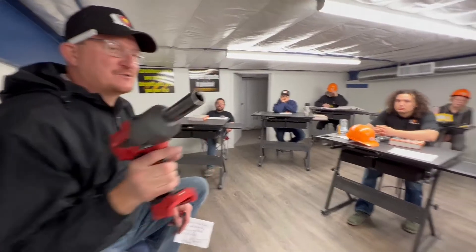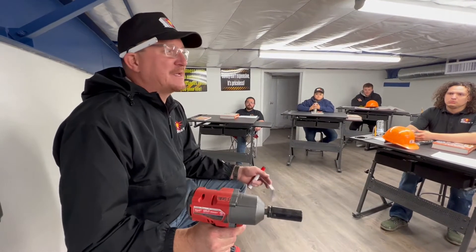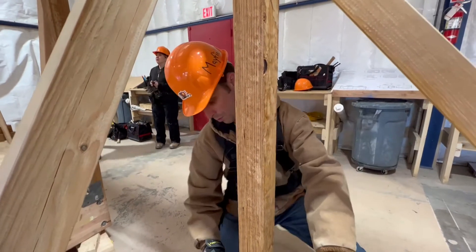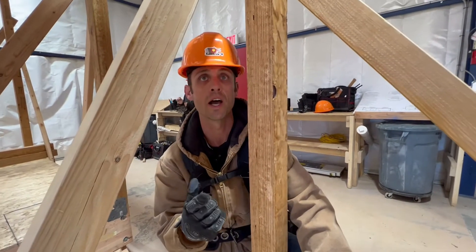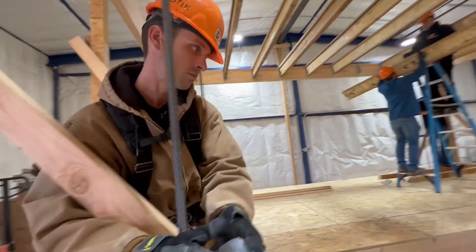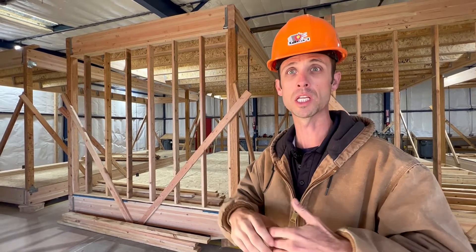Austin and I were just talking with Dan about laying out our walls all at the same time. You can snap lines and lay out your walls on your flooring, because then it's easier when you come to that wall to start cutting all the wood. On a regular house, when you do the sheathing on the ground, you make those chalk lines so that everything stays square and straight.